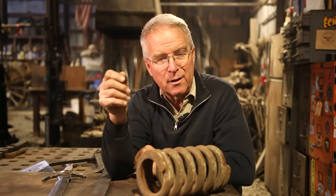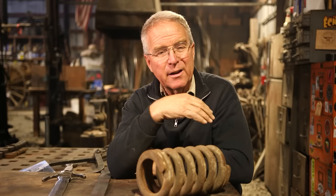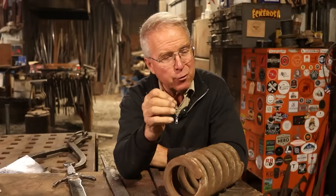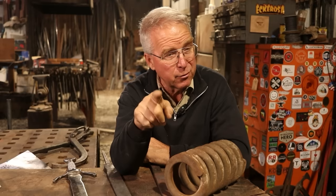They sell two broad general categories of belt: ceramic and aluminum oxide. The ceramic costs a lot more money, but the value is they last a lot longer. The belt line that's ceramic is called Cubitron 2. The way it was explained to me, there are intentionally triangular-shaped pieces of ceramic glued to the backing, and as those pieces fracture when you're grinding steel, they fracture into triangular-shaped pieces so you retain the fast cutting characteristics of the belt for a long time compared to the less expensive aluminum oxide.